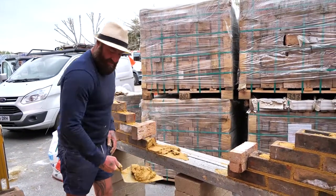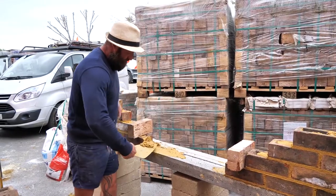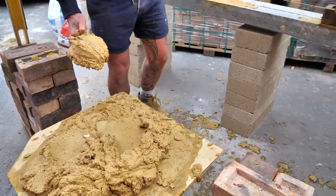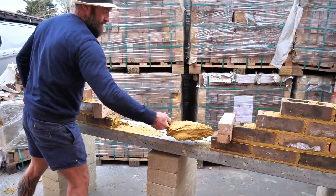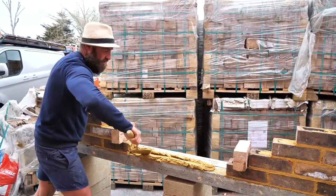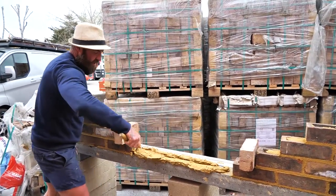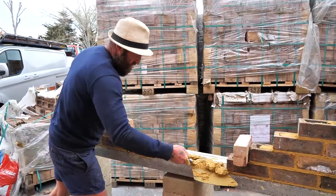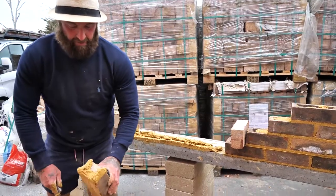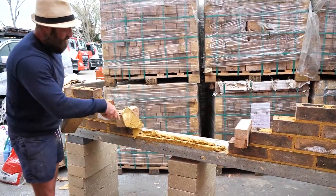So, start off with the micro techniques. Remember what I said, make sure it's nice and efficient. Get used to rolling your muck. There, sharp, here she comes in. Beautiful. Top coat with a trowel. Look at where I spread, look at where I'm leaning back and forwards with my right knee. There, in she goes. Good. So 1, 2, 3, 4, and we've got that brick on there, which is already made, what I've done earlier.